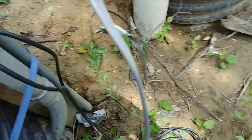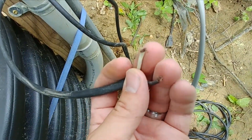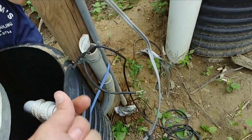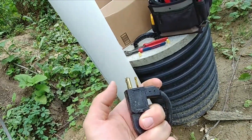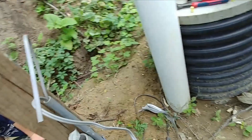Here are the three wires right here. This one is just a simple open-and-close for the alarm. Then we have one wire that is power going directly to the pump, and the other one is the float switch that turns the pump on and off. As you can see, they're plugged into each other — one behind the other — so this one right here is the switch and this one is just for the pump.